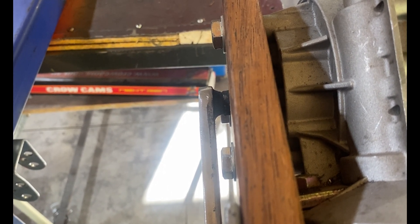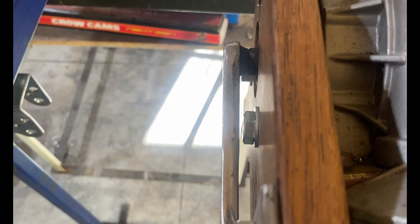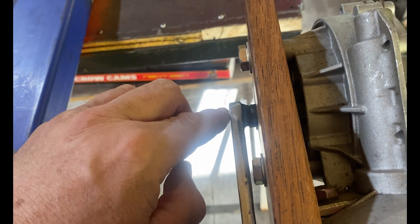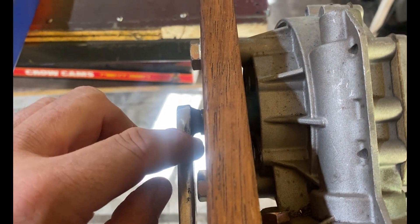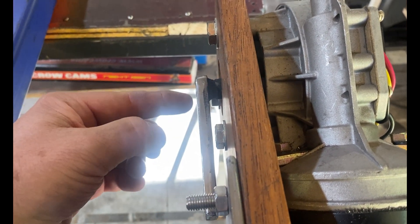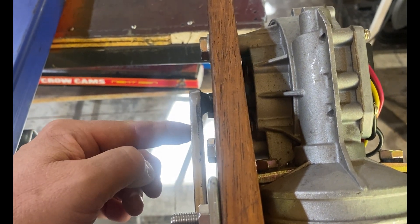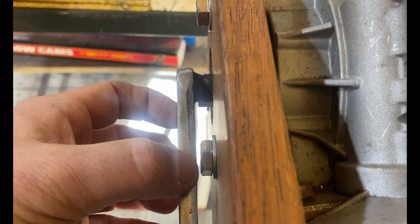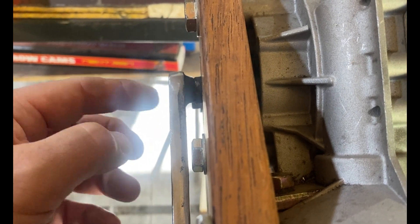When you weld those motor levers onto our motor shafts, it is really important to get them flush. Your clearance between your motor lever and our motor mount bolts is very, very close. If you don't get it flush with the top of your motor shaft — if you put it on too far in and weld it — you're in trouble because it's going to hit your motor mount bolts. It must sit flush to clear your bolts. Use these motor mount bolts when putting your lever on your motor shafts as a support — screw them out to get your motor shaft level. Get your little spirit level on your lever when placing it on your shaft ready to weld.